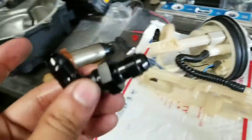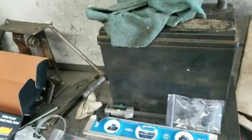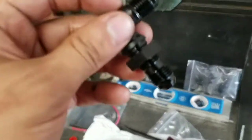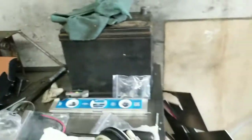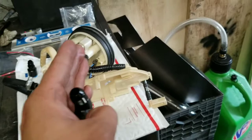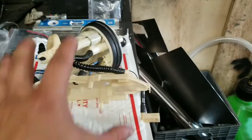Just enough so it can sit snug. You should have a washer for this — the customer did supply a washer but I have the correct washer. You also want to have a washer in there to prevent leaks. I'm going to drill and show you what the hole looks like. This is how you're basically going to turn an O2 to O6 RSX or the EP3s, EM2s, those kinds of chassis into a return system on the pump housing.